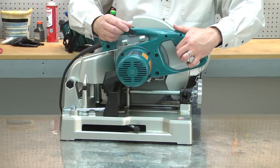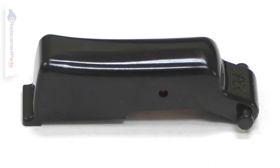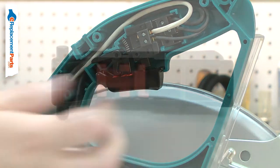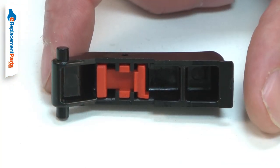The switch lever is pressed to turn the saw on. The plastic lever is attached to the handle. When pressed, it pivots and depresses a plunger on the switch, turning the tool on. Over time, the switch can fatigue and break.